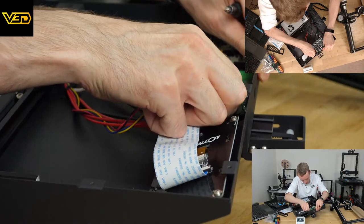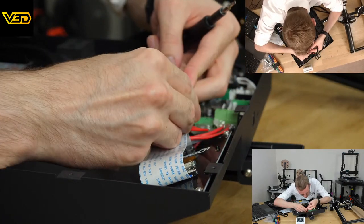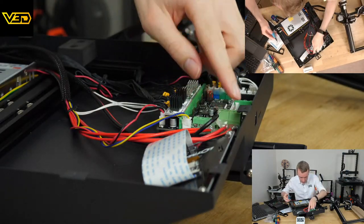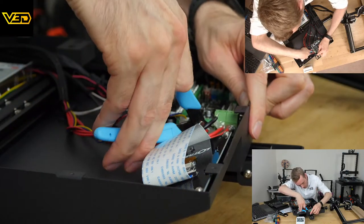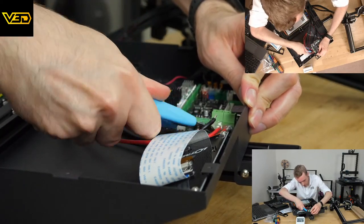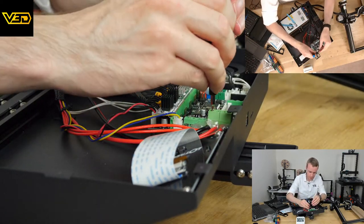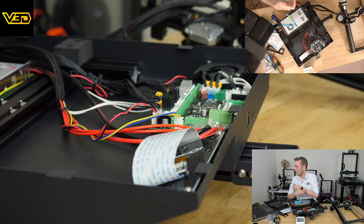Well, that's weird. Yeah, they've been soldered. So the wires have been soldered and they've been compressed. This is not great. The hot glue's all over the place as well. It doesn't seem like standard hot glue either because it's really, really flexible. It might actually be like an epoxy or something rather than hot glue. I'm making an absolute mess of that, but let's get that connector back in there. So that's not great. Tinned wires tend to deform over time because the solder kind of runs. It's like a very, very slow moving liquid.